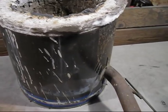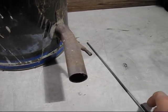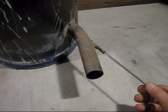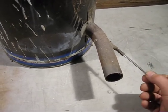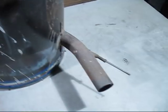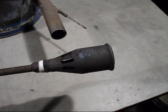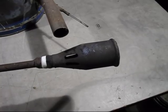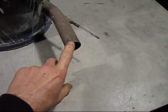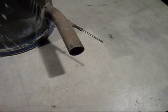This is my propane furnace and there is the propane burner. A lot of people seem to think that you need some sort of a jet — or as the Americans say, an orifice. We've got a really long rod here — we'll poke it up there — and that rod is 5mm in diameter. There's nothing in there. Propane burners that are naturally aspirated have to use a jet or orifice to create the induction to drag in the air. But with this one it's not needed because I'm running a blower — in this case a vacuum cleaner — to blow the air in. And it gets very hot inside the furnace with this type of burner.